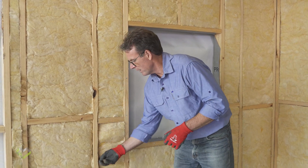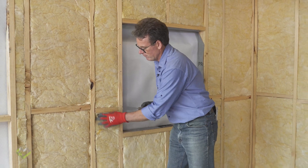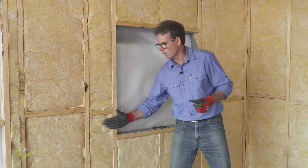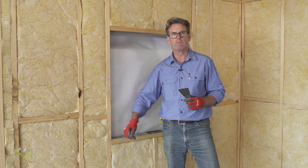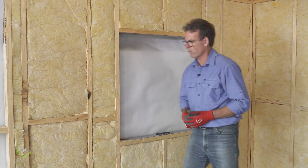So it's a matter of making sure our insulation is fully recovered out to the face of the stud, so when the plasterboard goes on, the plasterboard — our air barrier — abuts our insulation and we knock out any of that thermal leak.